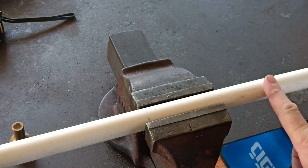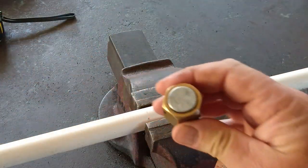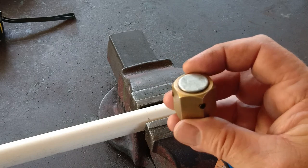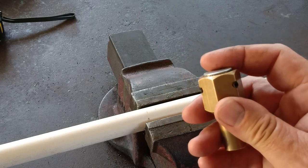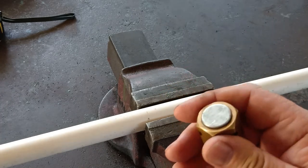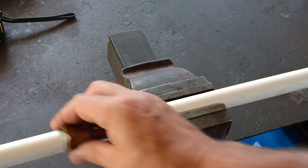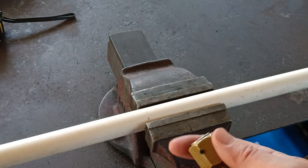I've just found myself a bit of conduit that I had kicking around at the back, and I found this neodymium magnet that's in a brass housing. This was an N42 magnet - damn strong, hard to get off the bench sometimes. So I've got to machine the outside of this down, get rid of that hex pattern, there's a couple of grub screws there I can get rid of, and it should slide up and down inside this conduit quite easily.